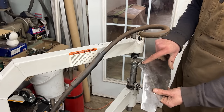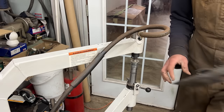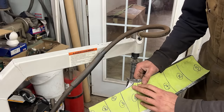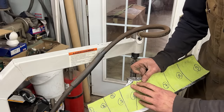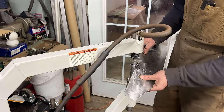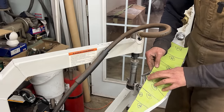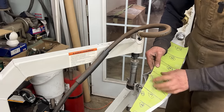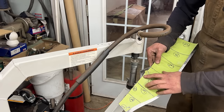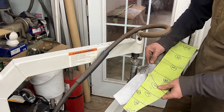I'm gonna just go around this area here and stretch it. You see how we are creating a shape here now, volume. So let me bring the pattern. We need a lot more to be stretched here. You see, wherever we have wrinkles, that's where we need to stretch more. Here we have just enough material, you see? But here we need to stretch more.